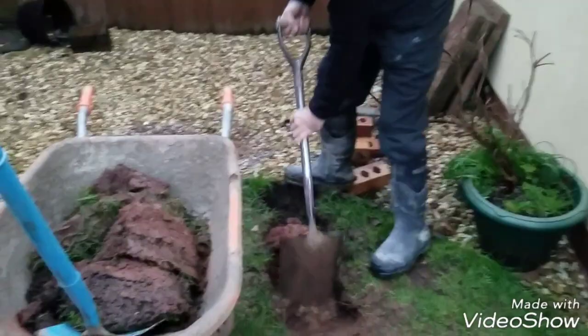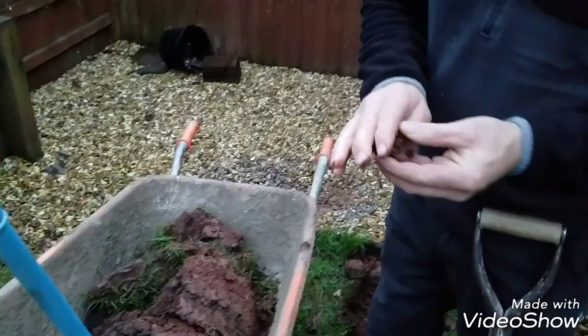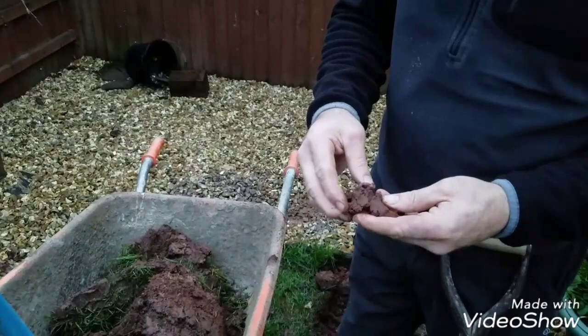The reason for that is usually always the same. What we have here is the so-called topsoil, but if you look at that — absolutely solid. It's great when you're doing a patio and you've got that underneath; there's not a lot of digging. But where the problem lies is that this simply is clay — and there's the test for clay: when you squeeze it, it stays together. And in there, there is no stone or grit of any sort.